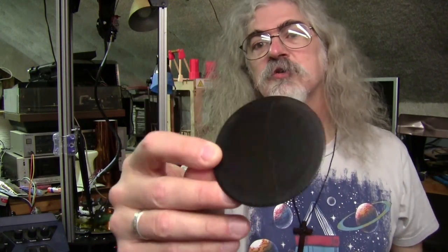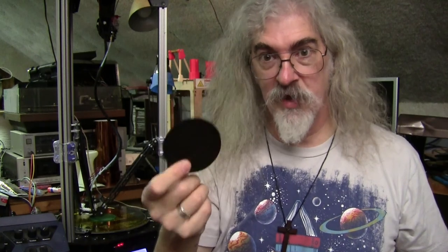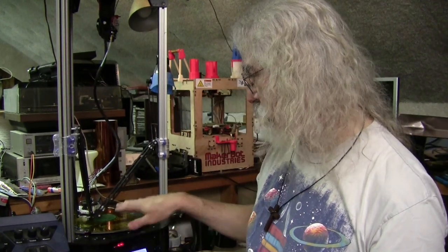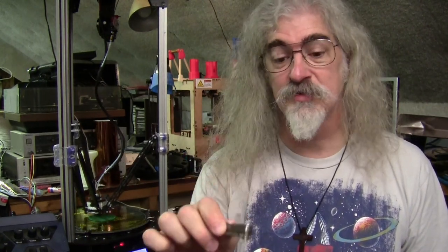I have essentially a whole card deck full of drum head samples at various different thicknesses, testing adjustments to the accelerations, first layer filament output — which I'm now at 225% — and layer height. I calibrated it with a feeler gauge, which I think you should always do, not business cards, not a piece of paper. They're too inconsistent; you never know what thickness you're actually getting. Use a feeler gauge — they're five bucks, guys.